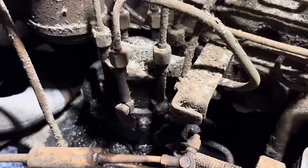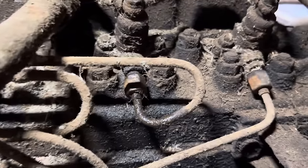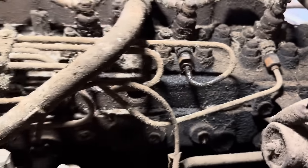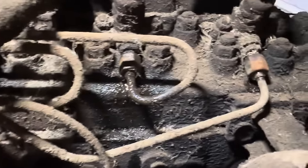I'm just going to bleed the injector pump again just to be sure, because everything is pretty dry in there. I reckon if I undo the bleeders on the pump and just make sure there's no air there before I start warming the starter motor up too much. We've just re-bled the pump now — we might have got the slightest bit of air out, but every bit helps. We have got a bit of fuel coming out of some injector lines at the injectors, but not all — so a bit more cranking and just see what happens. We don't want to overheat that starter motor. We've got fuel at all injectors now — my smile's probably starting to get a little bit bigger. We stand a pretty good chance. I'll go and tighten up all the injector lines now and see how we go.